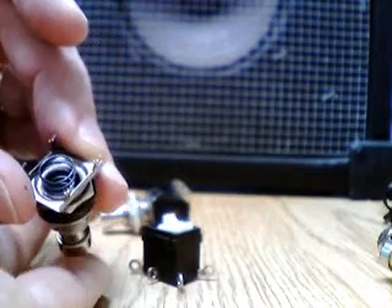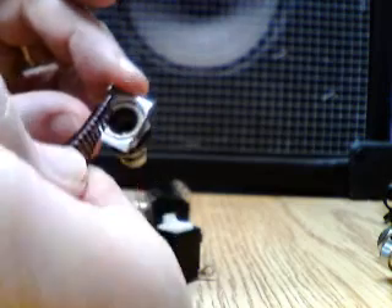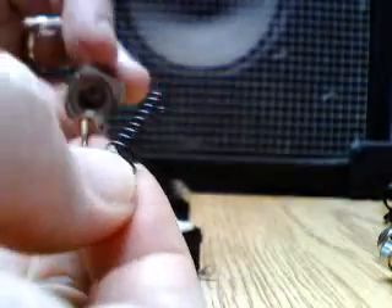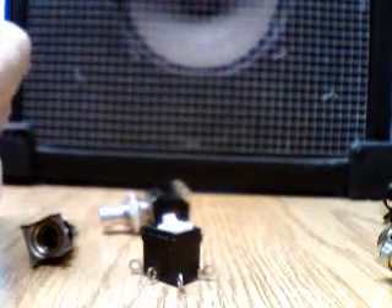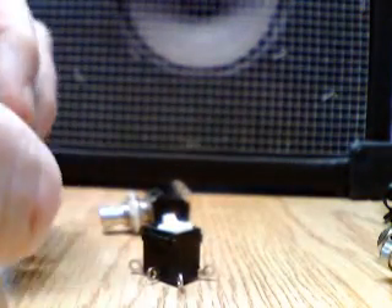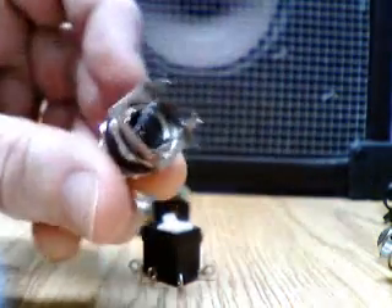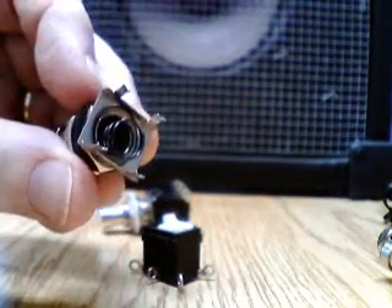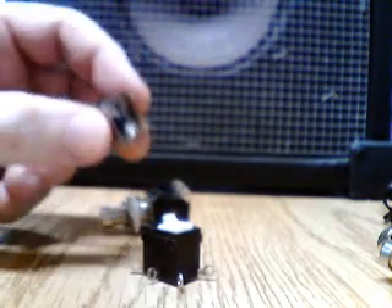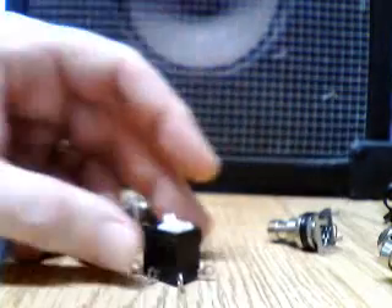Here we have a moving piston. Inside there is a spring — skinny side in — and a little plunger that you can see here. It comes out; let's put it back in the moving part. This just grips onto the chassis with some tabs. You can pry them up and then put this back on the chassis and squeeze them shut with the appropriate needle nose pliers.